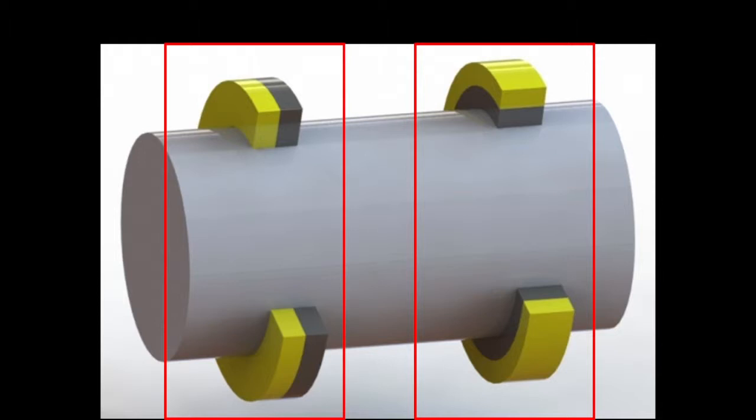After installing each ring and tamping them into place, the gland should be pushed against the top ring and the bolt should be tightened finger tight. Now we are ready to start the pump, and we will be discussing that in the next video.